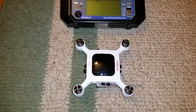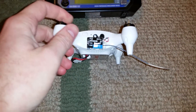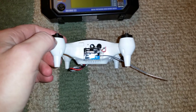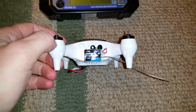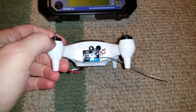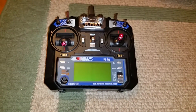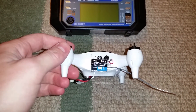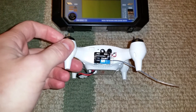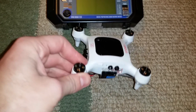I have made some progress and wanted to show that. I have successfully installed the Flysky FS-A8S micro PPM receiver. However, because I've done the 10-channel firmware hack on this radio, I have to use iBus, so there are a couple of extra steps I'll have to do.